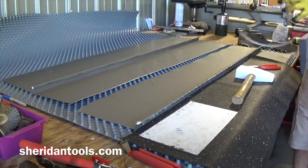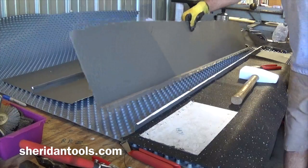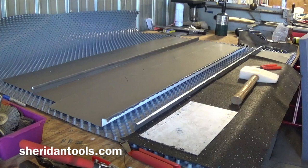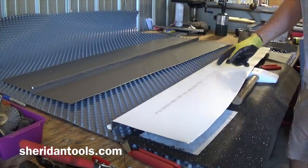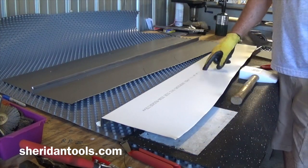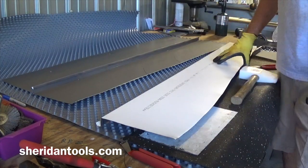Alright, and once that's out of there, you can remove this side. It should come off no problem. Okay? Now, if the roof's already been peeled and you're trying to figure out rolling direction, then before you take this piece off and start turning it around, just flip it over. Make a note of which way the print is running, so that when you make your replacement panel, everything lines up, okay? Everything's moving in the same direction. Do that when you pull the panel.